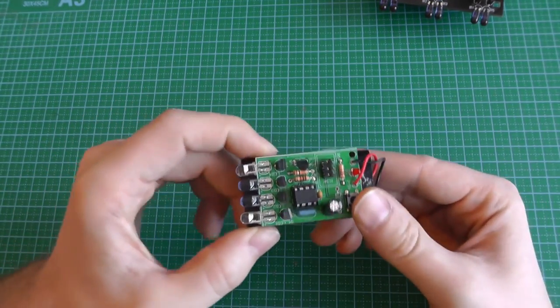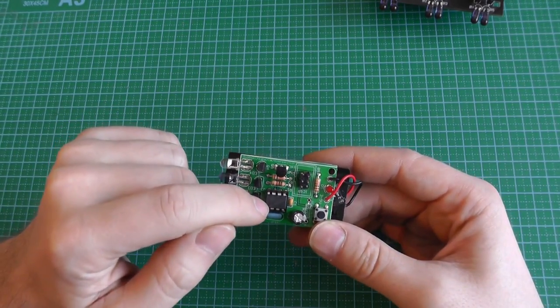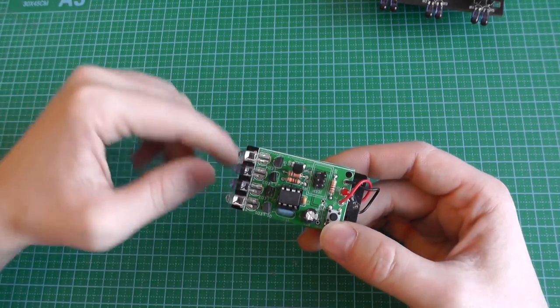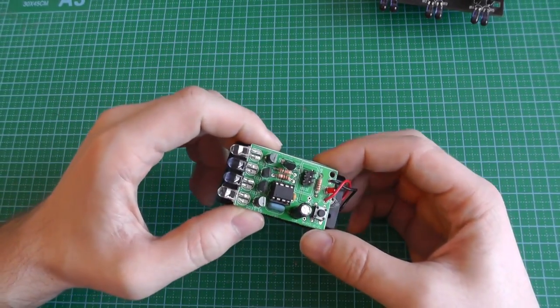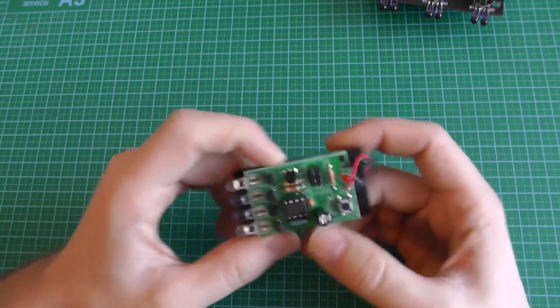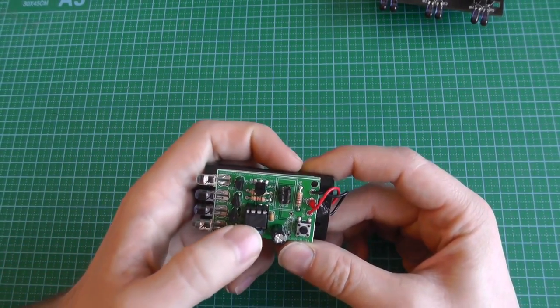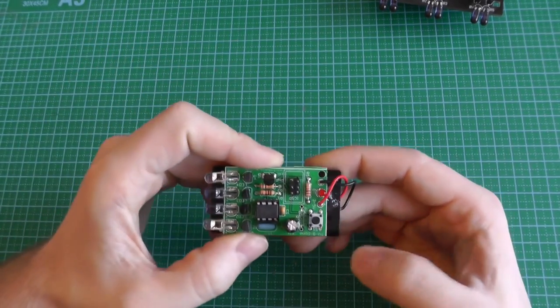This is why it's called TV-B-Gone. So you just press on it, and then all the codes are stored in here, and it will go through all the codes and try to switch off all the TVs. And with that, there's actually everything I need. I needed a microcontroller, which I could program. I needed LEDs, and I needed one button.